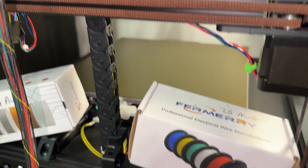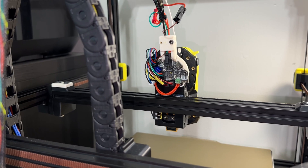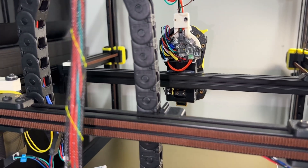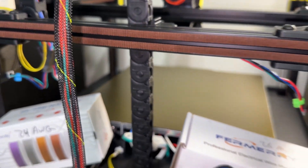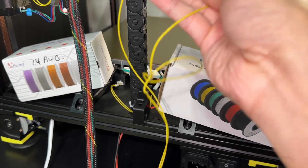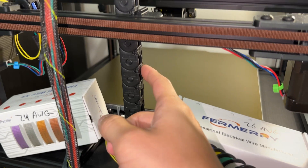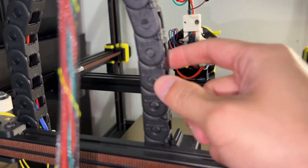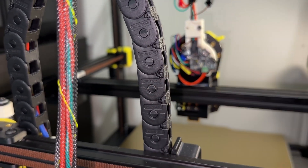The eighth video was endless decisions regarding hotend and electrical choices. The mistake here is buying wires before figuring out your final setup. I decided on CAN bus ahead of time and planned accordingly. If you change your mind to CAN bus after buying 250 feet of expensive PTFE wiring — oof. That also means you probably bought X and Y cable chains, which are scrapped when using the CAN umbilical cord. If those were expensive IGUS chains, that's just wasted money.